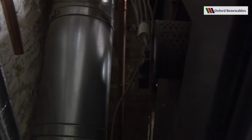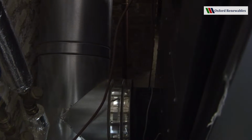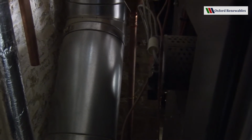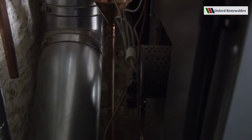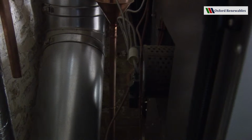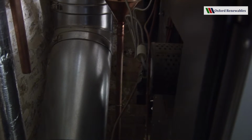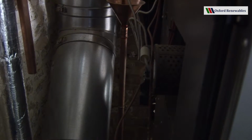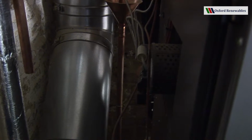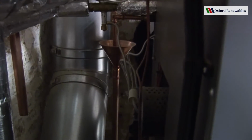That's why it's very important that the flue connected to the boiler has enough natural draft to take the products of combustion away. So the fluing with these boilers is very important and should be at a minimum 4.5 meters long and completely straight where at all possible. The flue also needs to have a cleaning access so that the flue can be swept. We recommend twice a year, but please consult your chimney sweep to find out how often he believes it needs to be cleaned.